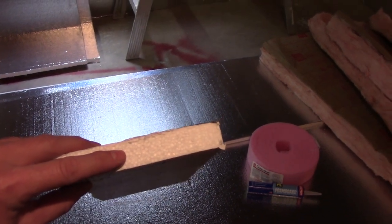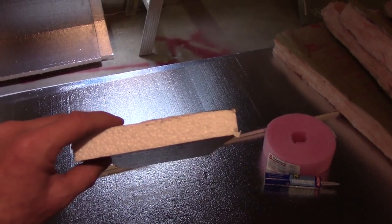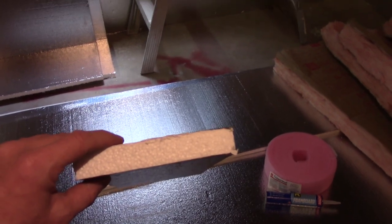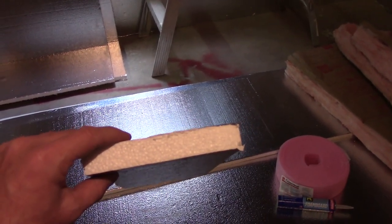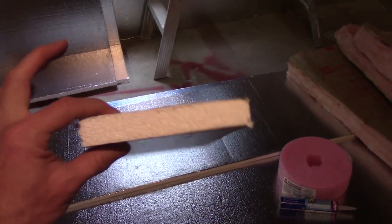You can look into what polystyrene beads actually do - there's a lot of theory behind it. The best illustration I can think of is a styrofoam cup. When you put hot coffee or cold liquid in a glass on a hot humid day, you'll get condensation on the outside. A styrofoam cup - not usually. So that actually helps a lot with moisture transference and all of that.